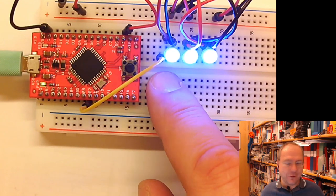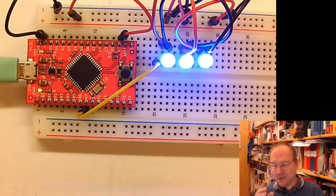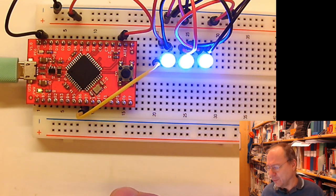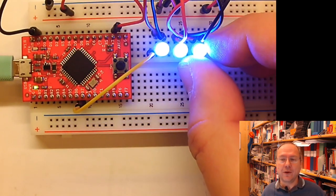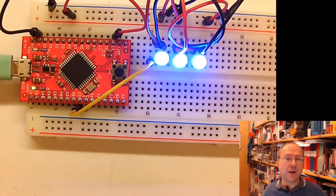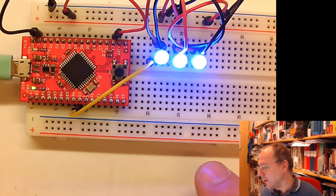What I want to show you, there's two things I want to show you here, but exactly, you could do everything in a single loop. Well, probably you would still need two loops. We'll have a look at that in a second. And then the next LED, this one, gets the last 24 bits which we are sending, but we could go on sending bits. You can actually buy these LEDs in strips.